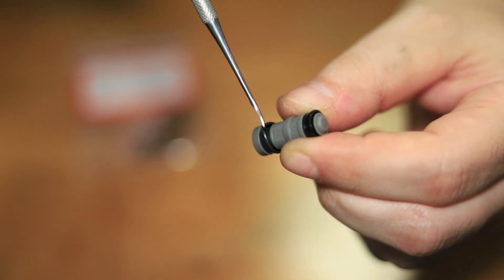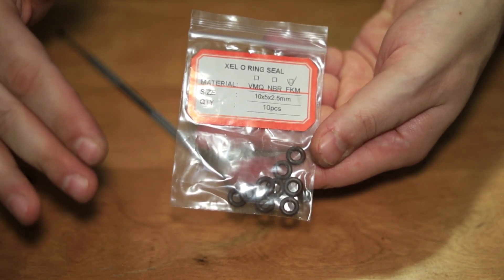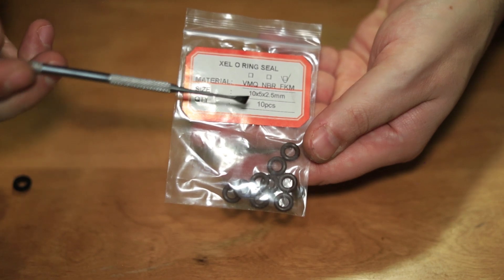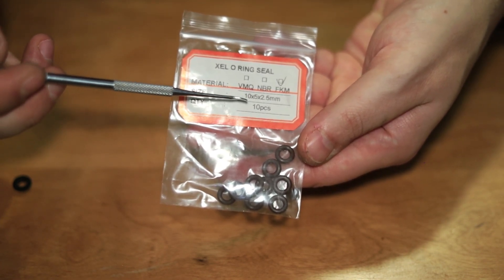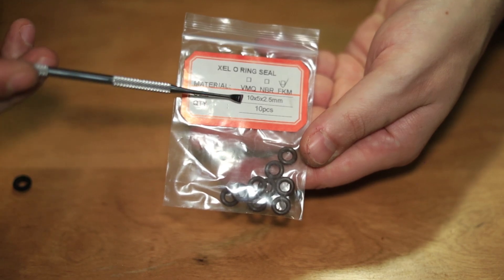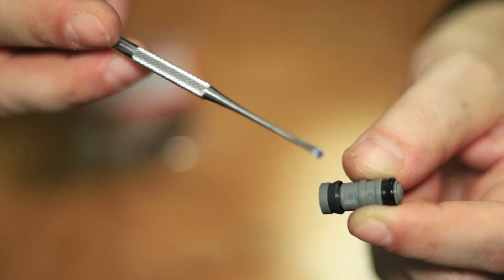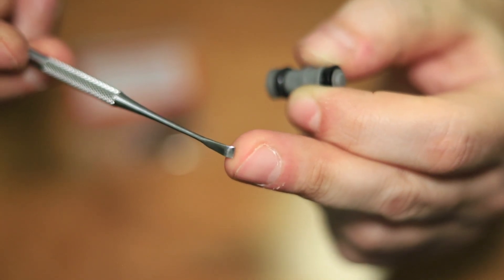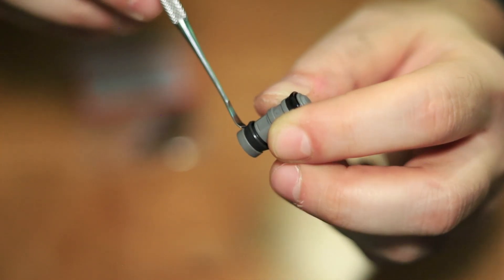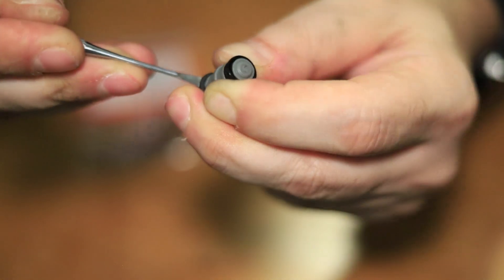What we're going to do is switch out the skirt seal for O-rings. These are the O-rings I ordered online — I did a lot of trial and error and these are the best size for the job. They're 10 by 5 by 2.5: outer diameter 10mm, inner diameter 5mm, and 2.5mm thick. I'll leave a link in the description. To remove the rear skirt seal, I use a dental pick with a non-sharp end that's easy to dig in and get these seals out — just get it underneath and pull it up.